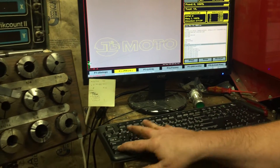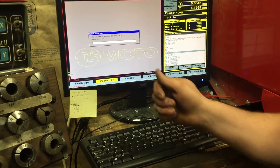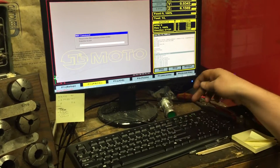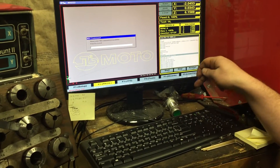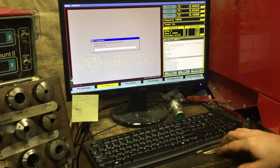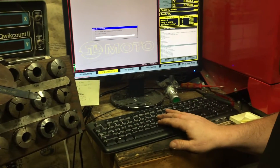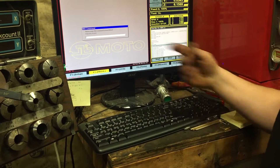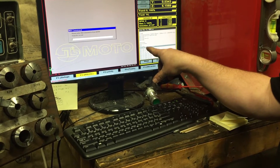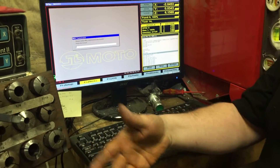Sorry about this, we're still new on the line number stuff. Can you just edit the code? I done that earlier — it took me 15 minutes to get to the top of it because there's a crap ton of lines, and you can't use the page up button to page through the code to edit it. That's something I was going to suggest to Hind Technology — a faster way up through the loaded G-code. Also, Fusion wouldn't post without a spindle speed, so I had to go in and take the spindle speed out after I posted the G-code.